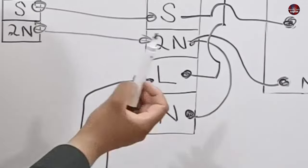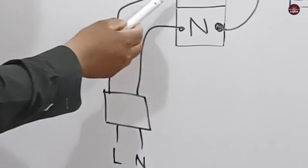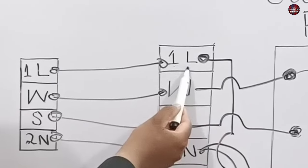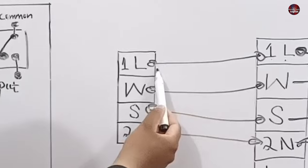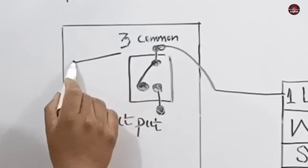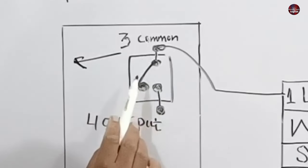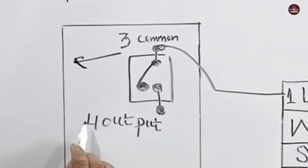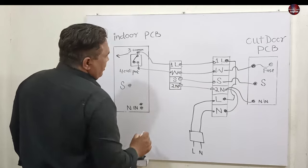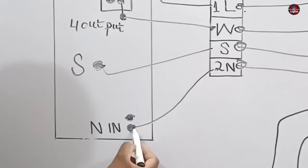The company has brought the line wire through to the indoor control board. The line wire connects with L, then with 1L, and 1L is connected to 1L on the indoor control board. The indoor 1L is connected to the common of the relay, and this supply also feeds further into the control board. When the relay switches, the number 4 connection on the relay — the output — connects with W. The S connects to S and neutral to neutral on the indoor control board.